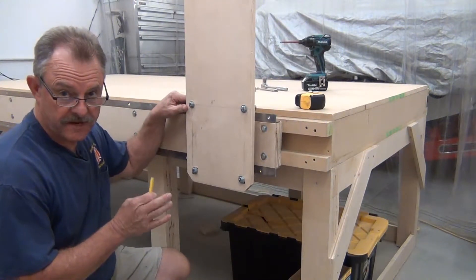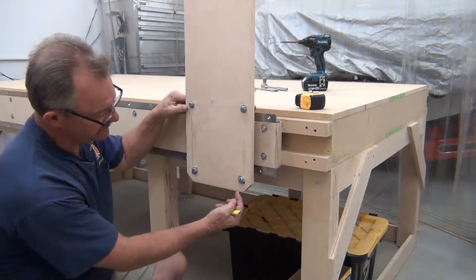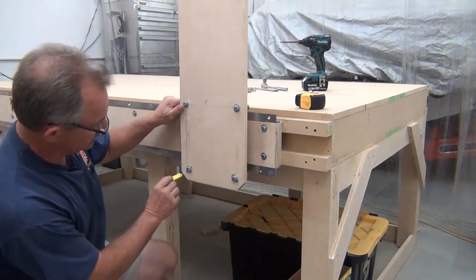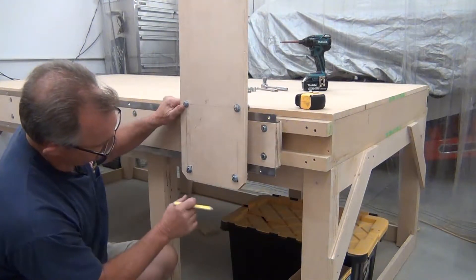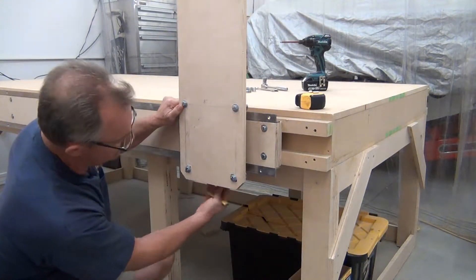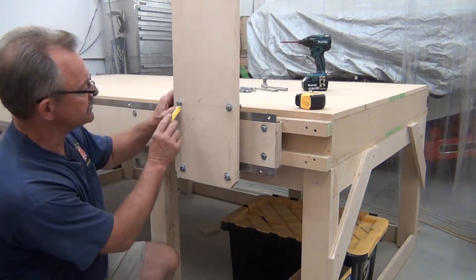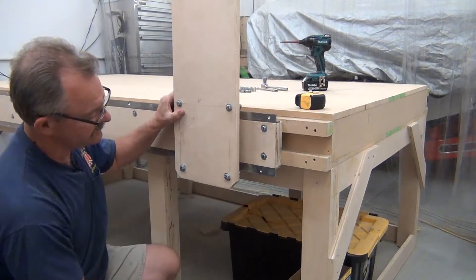I was able to use the same bracket because I had slots for adjustment, and I got the V-groove bearings to the height I needed to make this fit — it rolls pretty well. I'm going to use this as a template. I need to make it a little longer because eventually the motor will go here, attaching underneath to a rack and pinion to drive this back and forth. From center to center is 8 inches here, and 8 and a quarter over here.